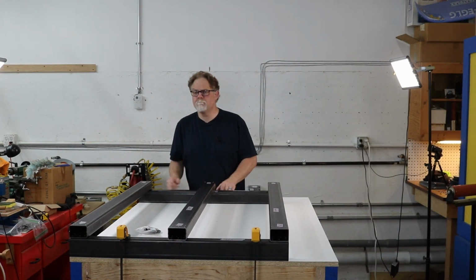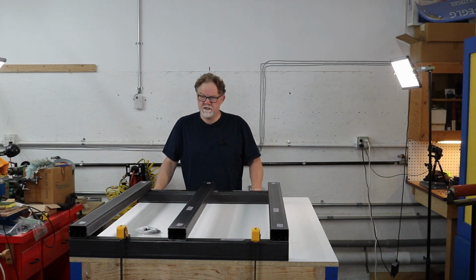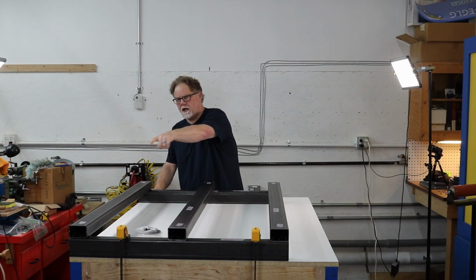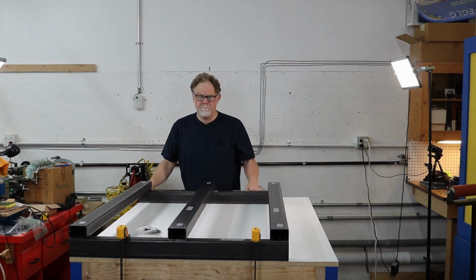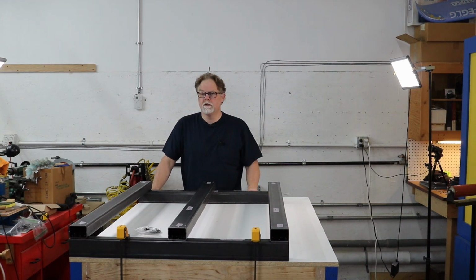So I got to thinking about it, and pinning that end is not necessarily a bad idea. The reason I say that is because I know for a fact I've got a good 90-degree angle here, and I verified that I can square this frame fairly easily. For those that don't know how it's done or how it's verified, you square a frame by measuring diagonally both ways and making minor adjustments until you get the same dimension both ways. When you do, you're square.